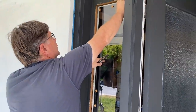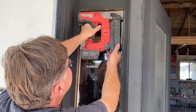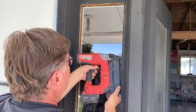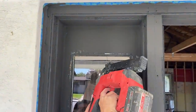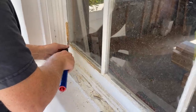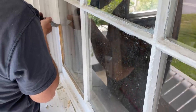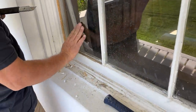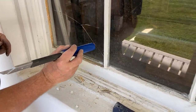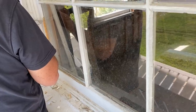The glass is in — it's so pretty, Jeff. There are a couple of little spots where the glazing starts to crack, like right here on the bottom — that's usually where it does. So we're replacing this little window because it's got a crack right down in there. You can see it. That just split right up when you knocked on it — and that's why it's getting replaced.